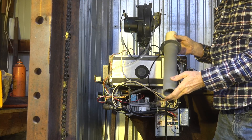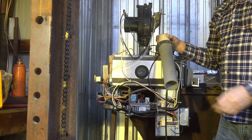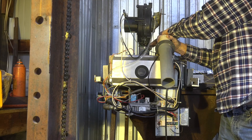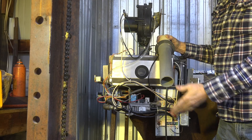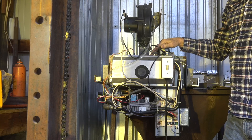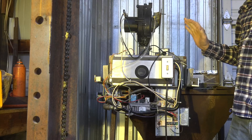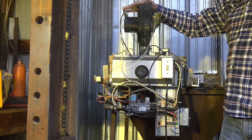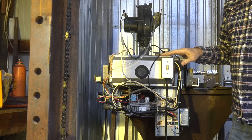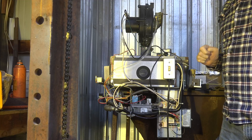This is the pipe here that came off of the inducer in the furnace. This piece of pipe fit into this fitting, and I just cut off a little short piece of it so that I could put it on to this fitting here, and it fit fine. So now what I've done, this inducer is placed up here to pressurize this combustion chamber, and that's going to put pressure on the burners so the burners will shoot out straight.